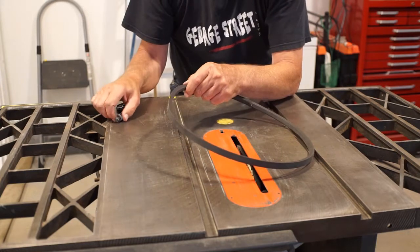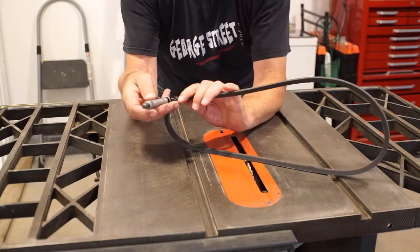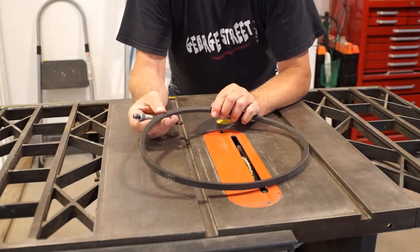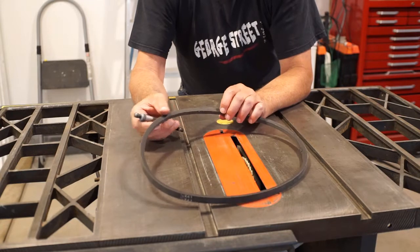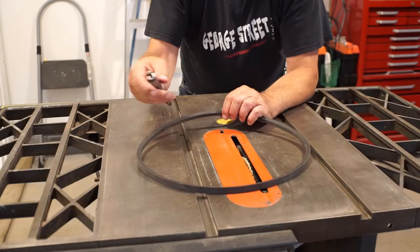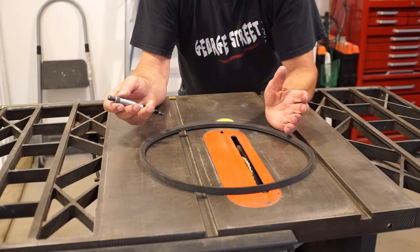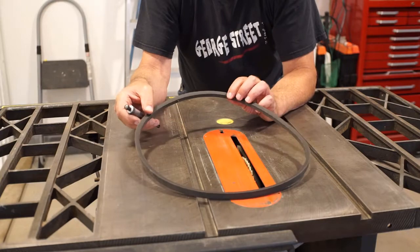But here's a problem. If I measure this belt along its length, I find that it has about 15 to 20 thousandths of an inch discrepancy — and it's a little hard to measure because it's soft, but there is discrepancy along the length. I went into town and checked out a couple of stores and measured the belts they had — they were pretty much the same, about 15 thousandths discrepancy on the width. So I stuck with my old belt.